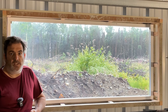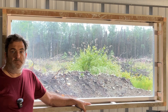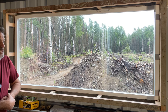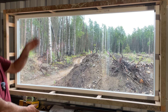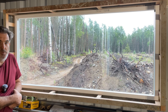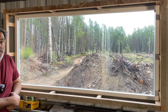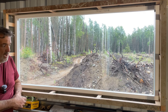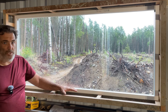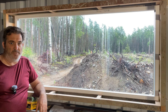Here's the result: a landscape insulated window using high-end vinyl framing and custom-made air gap window call-out boxes. I did have to modify my original frame design — I didn't account for a change in mounting. Originally I was going to have them supported vertically between the two girts, but I found it easier to get a straight line by shooting a laser, making some marks, and chalk-lining where the windows will go all the way around the building. Mounting this way also makes it easier to cut the sheet metal from the inside, where you have more flap so a saw or grinder can run across for a better cut instead of cutting across the top of the ribs.